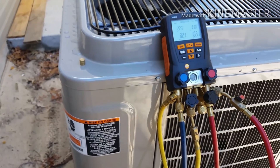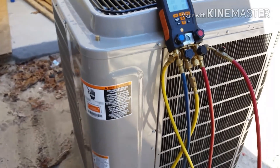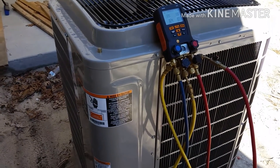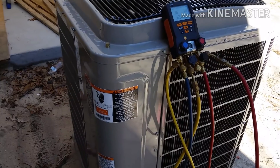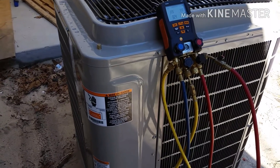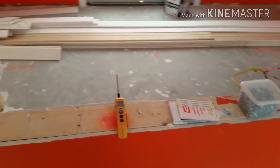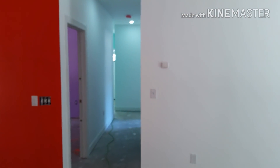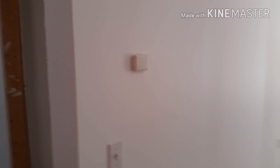We're going to take a look and see how well this unit is performing without auxiliary heat. We have it in test mode running at 100% capacity. We're going to go inside and see what the indoor temperature is and see what our supply plenum temperature is. It's currently 59 degrees in here. We've got sensors set up averaging throughout the house — single zone, just averaging sensors.